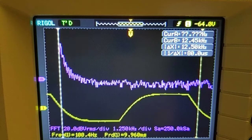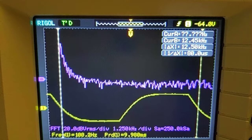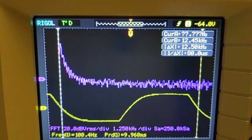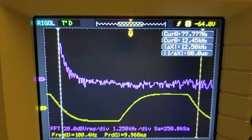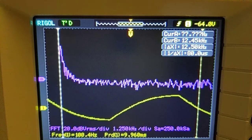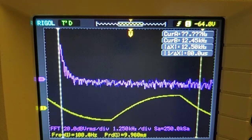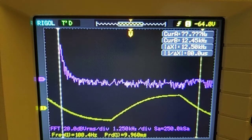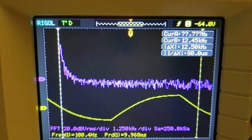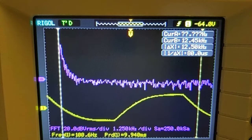It starts pretty quickly to go down but gradually gets there — it's almost like how fast a car can take a curve. If you have a slew limiter in your synthesizer, that's exactly how this works: the slew limiter takes a control and makes it either move slowly or move quickly. So the way I think about these two filters: this simple first-order filter operates in the time domain — it's how fast can this voltage swing back and forth. Let's go back to the leapfrog and turn it down to 100 Hz.